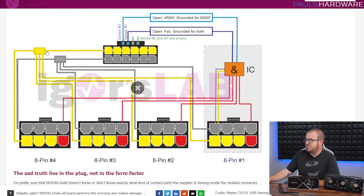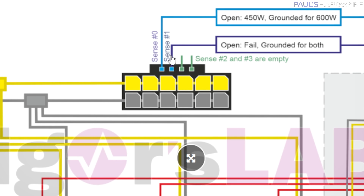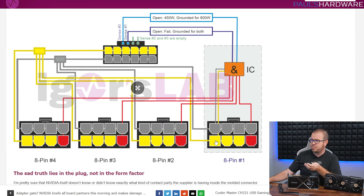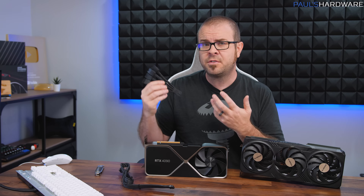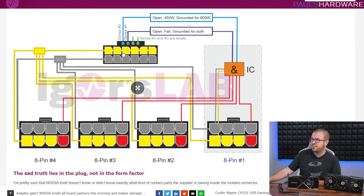Here's a schematic showing the electrical connections between your four 8-pin power connectors and the 12-pin adapter. The pins marked in yellow are the 12V pins — the ones that actually matter. On this schematic, there are not individual connections going between the connectors; all of those connectors from the 8-pins are bridged together over to where the six 12V pins pass through the 12V high power connector. Of the four sense pins on top, two are actually empty and not currently being used. The others are wired through a logic board within the adapter that indicates whether there are enough connections to provide 600 watts or 450 watts. To provide 600 watts at 12 volts, you need 50 amps flowing through it — distributed across 12 different pins with 8-pin connectors, but only across six pins with the new connector, still within PCIe 5.0 spec tolerances. If one of those six pins didn't have a good connection, the 50 amps would distribute across the other five — about a 16 to 17 percent reduction — probably still not enough to cause melting.